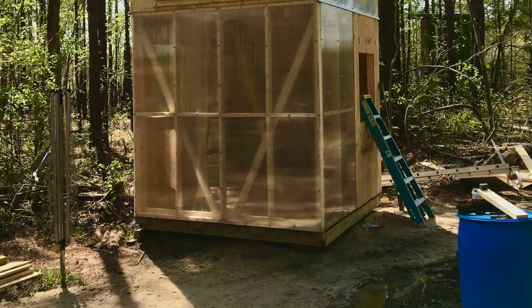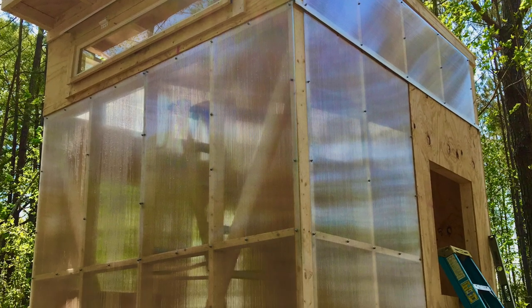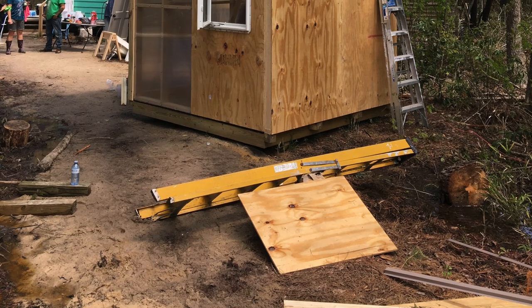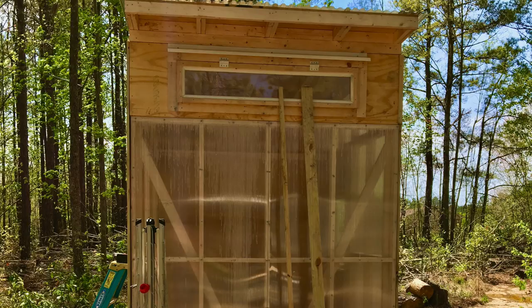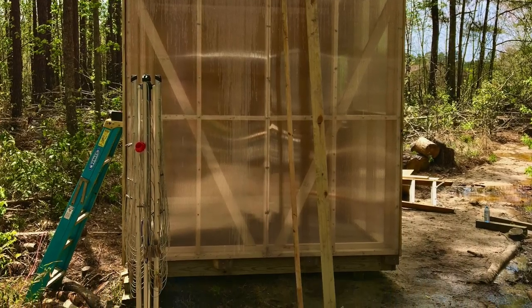The front of this, of course, you can get a lot of natural solar gain. You can see the diagonal supports in there to brace things, because without any triangulation this wouldn't be so rigid. Structurally, I'd probably side this with shingles. You could also triple coat or paint it with good exterior paint to kind of button it up.